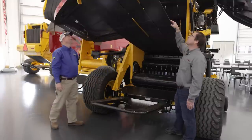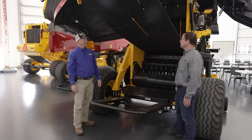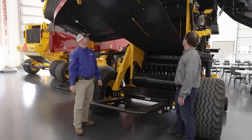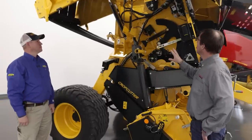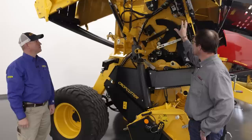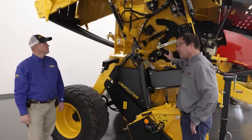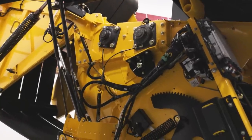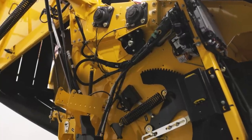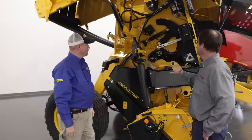The rolls inside just look massive — they have to be bigger than on the standard baler. They're about 70% bigger in diameter than the roll belt series baler. As we made our way to the right-hand side of the baler, I notice the bearings and the rolls seem to extend out past the bale chamber. The bearings are bigger on this baler because we have two twin drive rolls as well as bigger diameter rolls, which require bigger bearings.